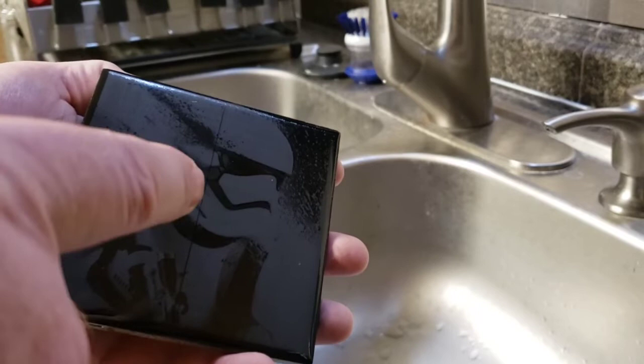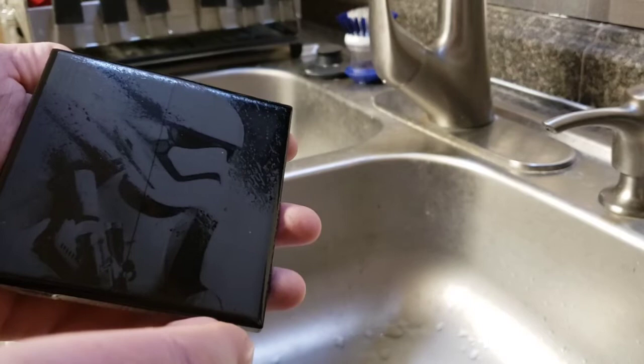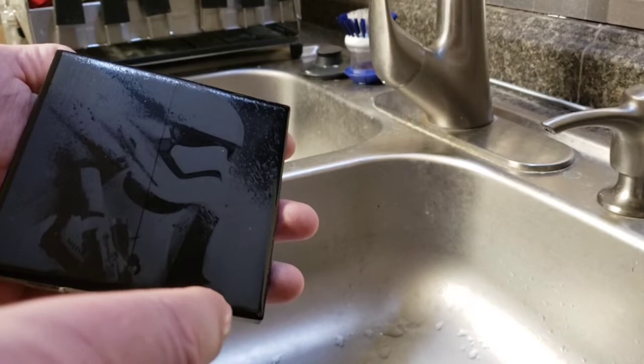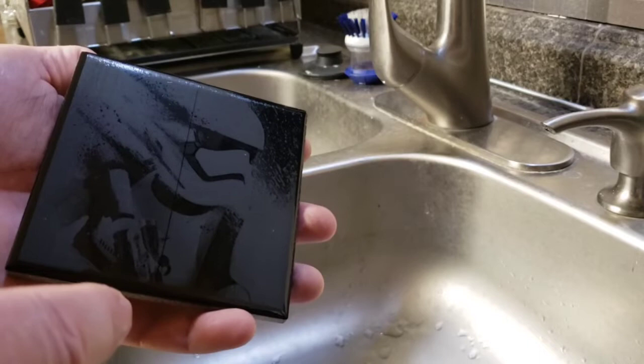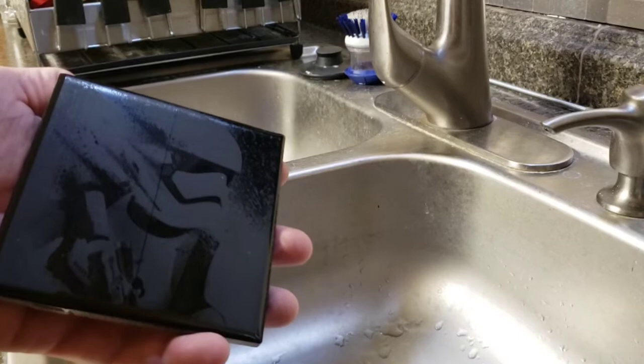Just be ready to stop it as soon as it tries to meet up — you really can't trust that second counter in the preview panel. But where it is good: if I was making a true test panel, I'd run it for five minutes, stop it, make an adjustment like ramping up the speed, then break it down into five or six increments — every five minutes stop it, ramp up the speed, run it again. When you brush it off you can see, and as long as you were consistent on how you stepped up each section, you can say 'right in this area gave me the best results — I need to run it at that speed with these settings.'